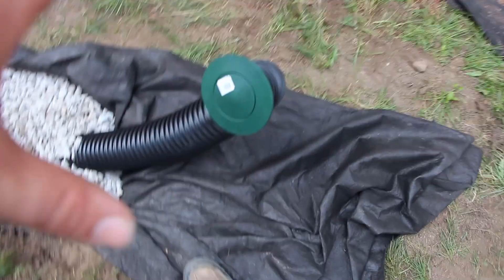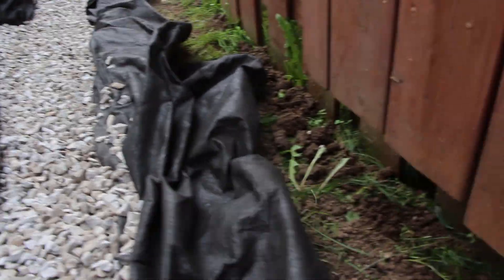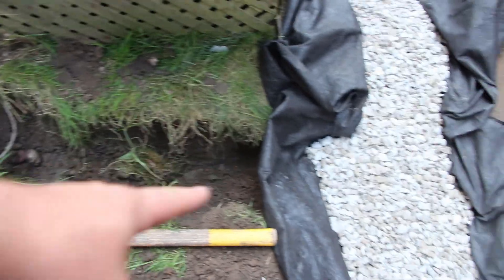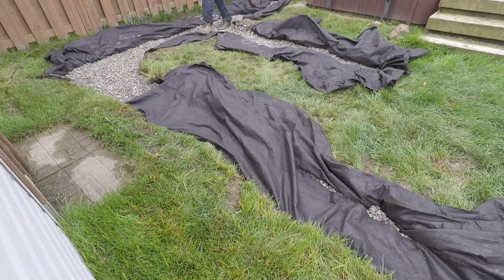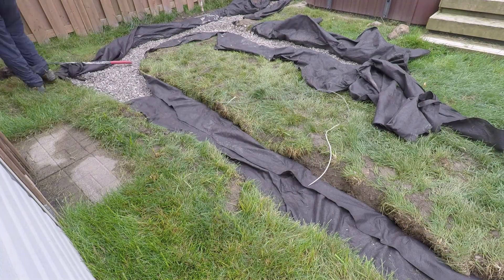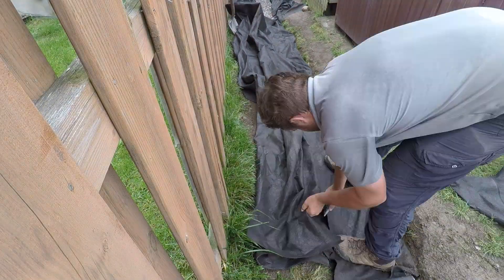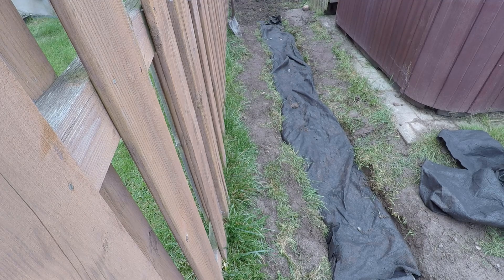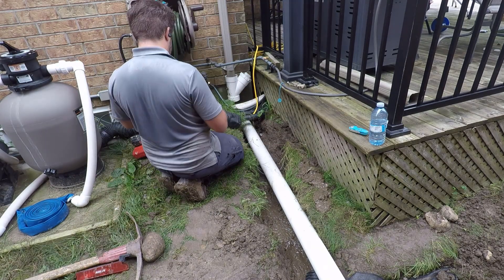So that's our pop-up emitter — I'm going to dig out and plop it in there. And then we're just going to burrito wrap this. We got one side going in, one side will cut off the excess soil and sod on top. Got to touch up some areas. Then we'll have a solid pipe coming in and tying into our tee.